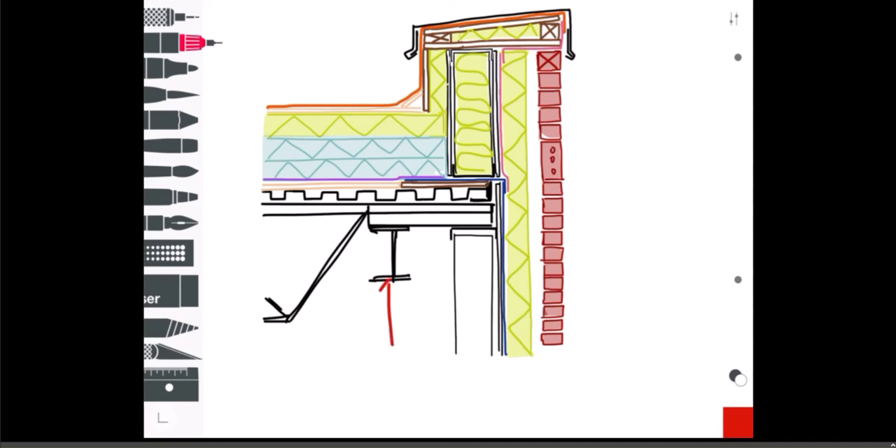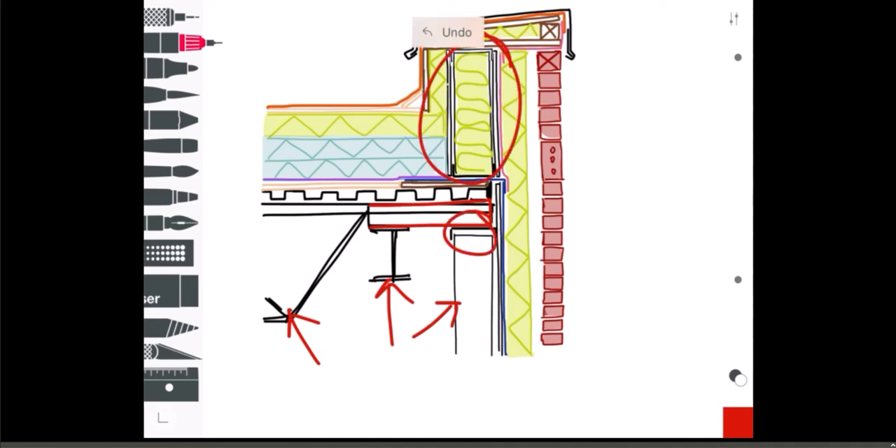For the steel structure there's a steel beam and open web steel joist. There's the stud wall right there — we've done a semi-bypass system again where we've extended the joist seat out. That pretty much breaks the parapet stud wall from the stud wall down below, which is a good approach and I'll get to that later.